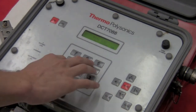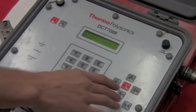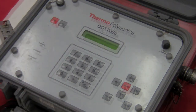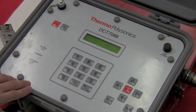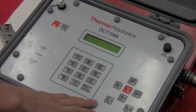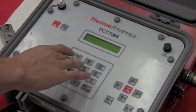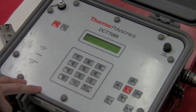After you do that, go to menu 16 — that's for your liner material. We don't have any. If you had a liner, you would go to menu 17 and set your liner thickness. Then press menu 20 — that's where you enter your fluid type. We're set for water, but you have different fluids built in. Then go to menu 23 and type in your transducer type; we have standard transducers. Menu 24 is where you determine what transducer mounting you want, which is dependent upon your line size and a couple other pieces of information.